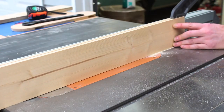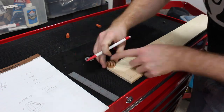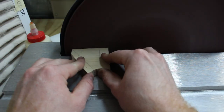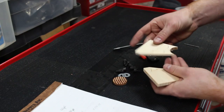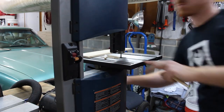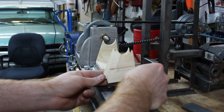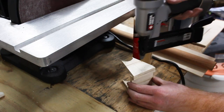Following the book, I split three-quarter inch pine stock to make five-sixteenths inch stock, ran it through the planer a few times to make it flat, and then proceeded to lay out the pattern. I used brad nails to attach the two vertical parts of the pattern, so that any sanding or shaping on one side would be easy to duplicate on the other. Then I pulled out the pins and made the base. Once I finished the sides, I noticed that the dimensions the book calls for didn't align with my headstock — the pattern was offset to the back by about half an inch, so I had to make a second set shifted towards the front of the lathe.